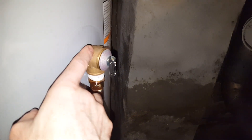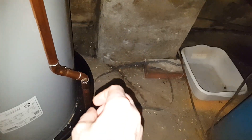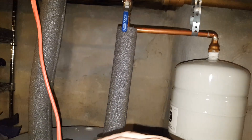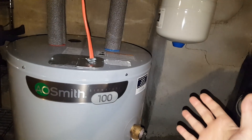So what will happen if your water expands when it heats, this temperature and pressure relief valve will open, and then water will spray out a little bit that expanded. And if your T&P valve is not working, and if you didn't have an expansion tank, when the water heats up and it has nowhere to go, it could either cause a leak, it could damage some of your equipment — either the water heater or a faucet or something — or it could even explode.